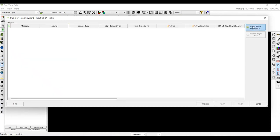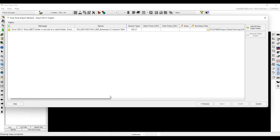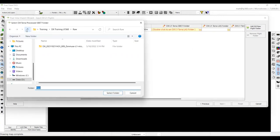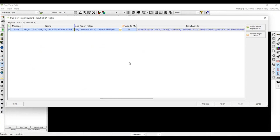We'll click next and go to add the DJI RAW folder — this is going to be the Zenmuse folder. We'll select that, and then grab the folder that has our SBET or the trajectory file, which is going to be in your DJI Terra project under your LIDARS folder. The last thing we're going to do is add the Terra LAS layer within this software.